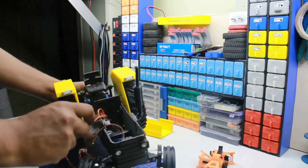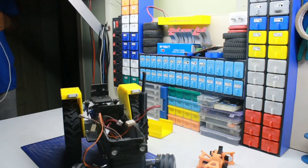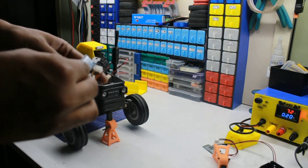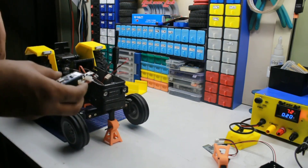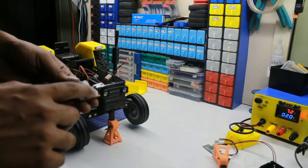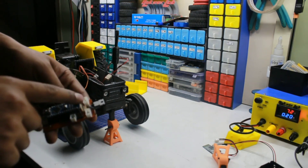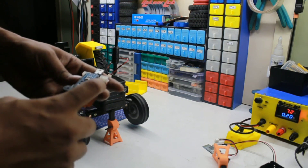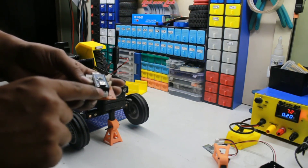I will show how it looks. Let's wire our controller circuit. This is how Arduino Nano fits in our controller board. Here, this is for right indicator, this is for left indicator, here for two motors — I am only using the driving motor now. This is steering servo, this is lift servo, and this is for battery connection, front LED light, and Bluetooth module.